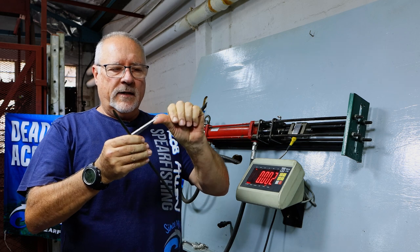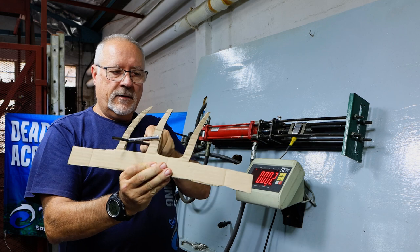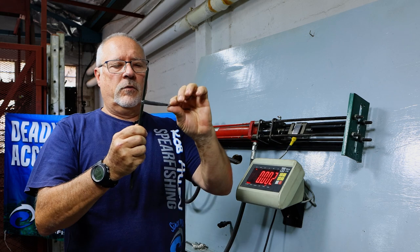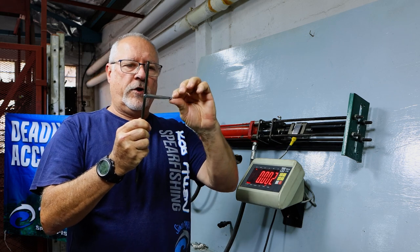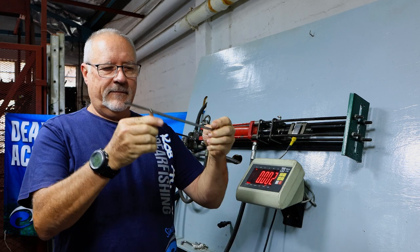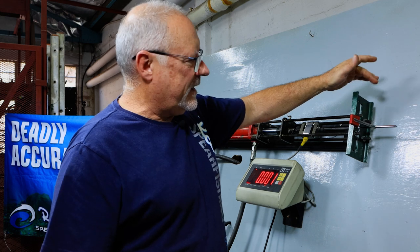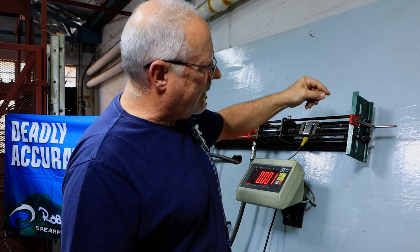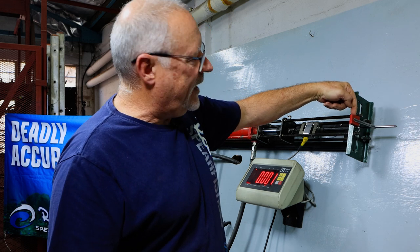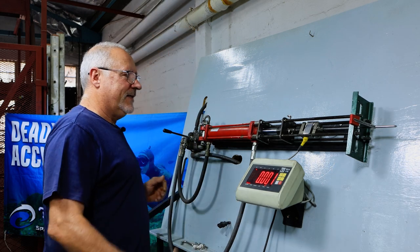We'll try another one and load it even further along, simulating the position it's in — as you can see it can quite easily destroy it if you hook the barb much further away from the spear. We've modified the jig quite considerably. The spear that's in here is our standard spear, unplated, so it's exactly the same tensile strength. The barb is exactly the same but now it's set much closer to the edge. This should go even less than the previous one.